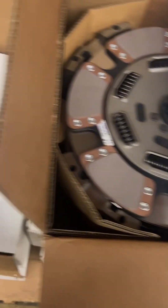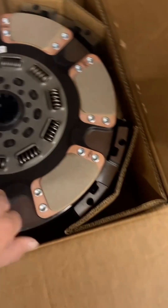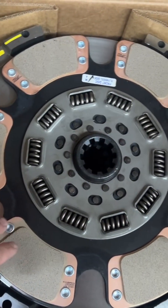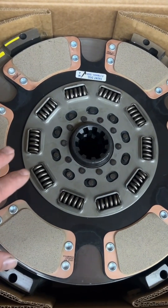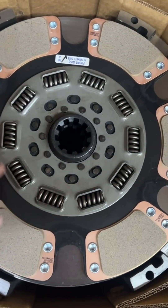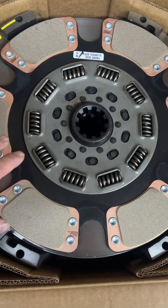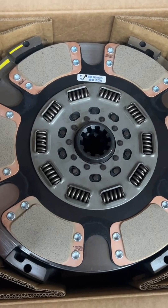We recommend going straight from a four-pad clutch directly up to the VHD, which is a heavier-duty clutch. In addition to that, we also offer a 10-spring clutch, most commonly used in an RT transmission — 13 or 18-speed. It's got 10 springs in it, and this thing is a beast. It's rated for 2,050 foot-pounds of torque and is an absolute animal when used in the right application.